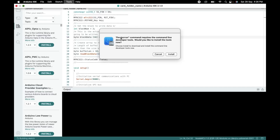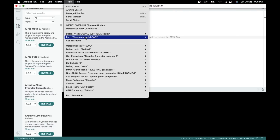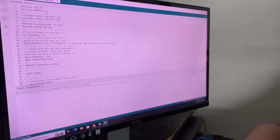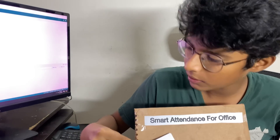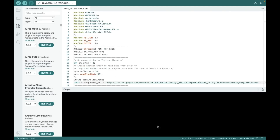Let me choose the board and the proper port. Go to Tools and select the board, which is NodeMCU 1.0. The port for me is showing USB Serial — in Windows it would be seen as a COM port. Now let me upload it. The code has been uploaded. Let me scan the card — I'm using this blue tag. I've scanned it. Now let me change the name to my brother's name, which is Fuzzle, and upload the code. Now the code has been uploaded. Both the tag and the card have their names stored.